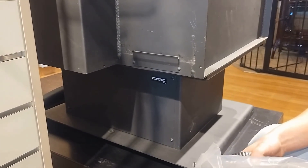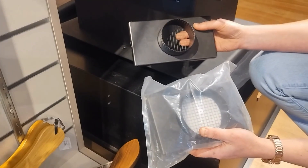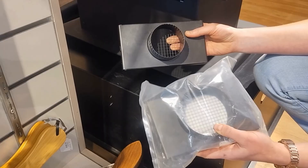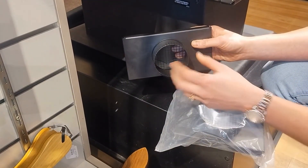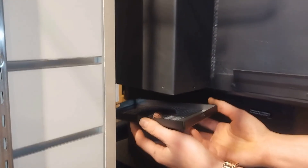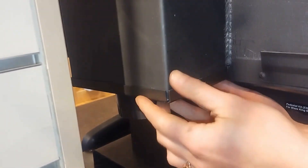Now we've come to the back of the stove to talk about the pathway that combustion air takes. This stove does offer outside air combustion options if you like — it's not required. You can choose between a 3-inch outside air intake or a 4-inch. They recommend 3 inches for an equivalent venting length of 11 feet or less going outside. If you have more than 11 feet of equivalent venting length, you upsize to a 4-inch. Your outside air plate mounts to the bottom with two screws, one on either side, and you can source venting wherever you like to run it outside.